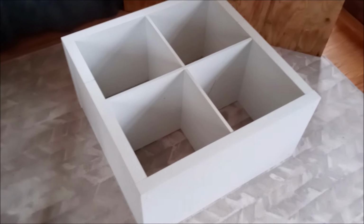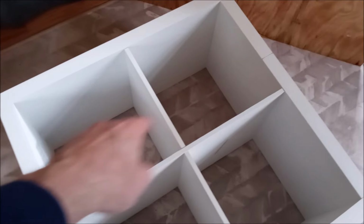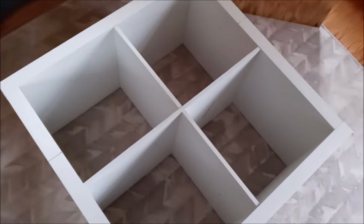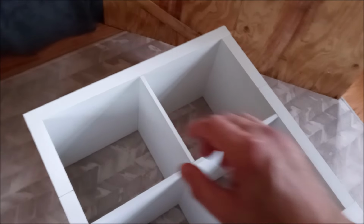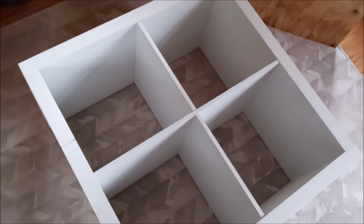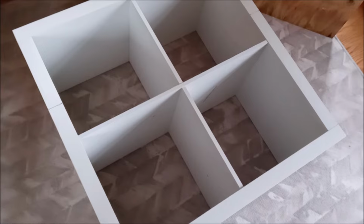I'm going to take the bottom set and make them sealed, and up the top I'm going to have this as partially opened so I get the benefit of the two different sounds of speaker cabinets. As you probably know, open back cabinets are airier sounding, for lack of a better word. There's more thrust, I guess, to the sound when the cabinets are sealed.